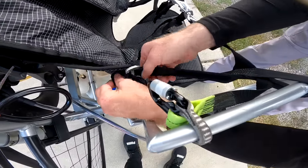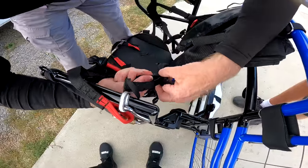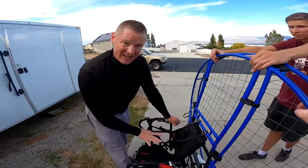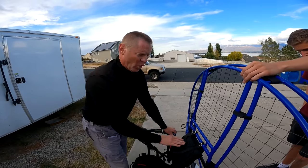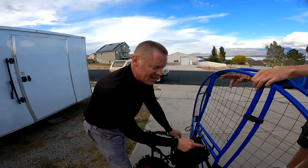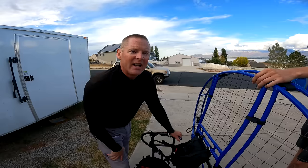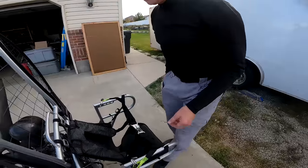The hang point and positioning is absolutely critical — it must not change. Certified height hook-in points are not adjustable. They're fixed. If you make them adjustable and give it to a new pilot, they could set it wrong, stall their glider out of the sky, and have no idea why. With the flat top, you can't mess it up.